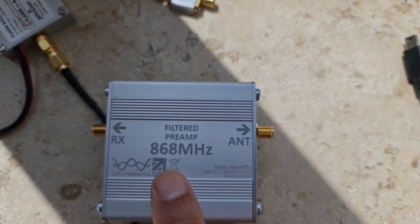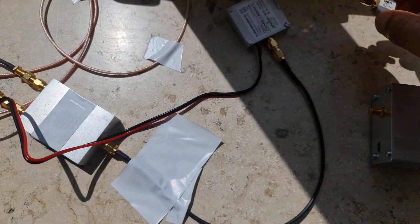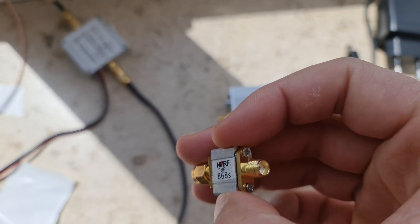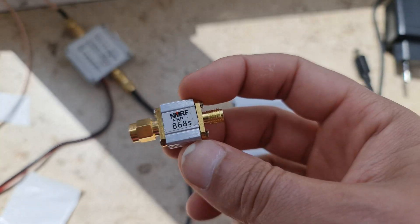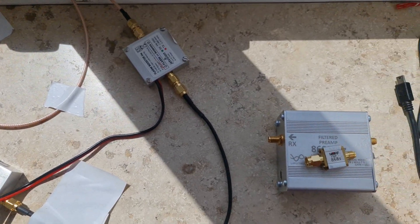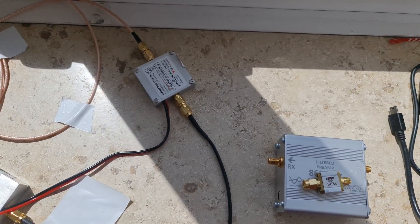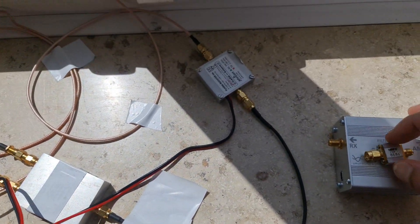Only if you have RX and TX separated. My opinion about cavity filters and SAW filters: I don't like them. They will filter the signal very well — people who get too much invalid, it may help them reduce some signal by 3dBi. But I recommend instead to set 15dBi in your Helium app — you will not get any more invalid after that, though your beacon will be weak.